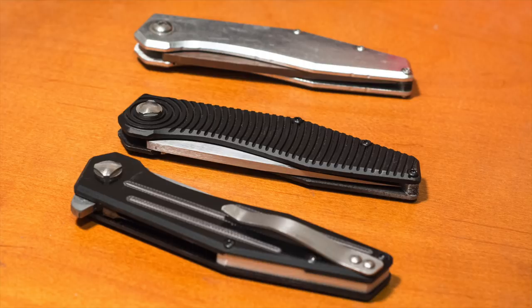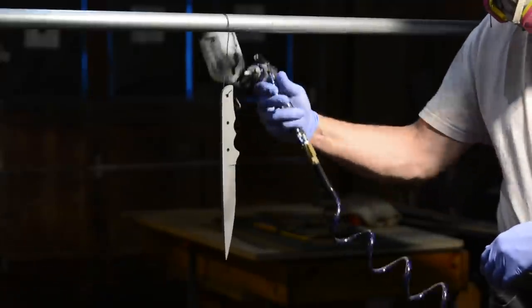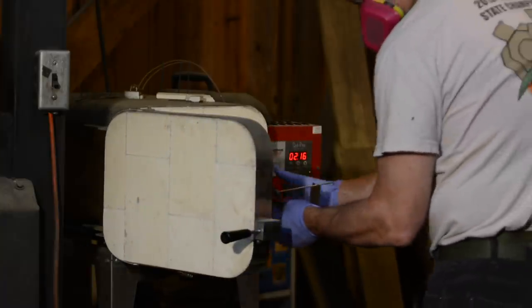You can use them to rust-proof a blade, or put them on the handles of folding knives — there are just innumerable uses for them in the knife-making world. I've been using firearms coatings for years, but not in really big quantities. Recently, in my Tactics Armory folder line, which I'm getting ready to start producing, I just needed a much more efficient and sensible way of racking up my parts to put them in the curing oven. The process is to apply them with a spray gun and then cure them in an oven. I had a jury-rigged rack, and it wasn't very efficient, so I wanted to think this through carefully.